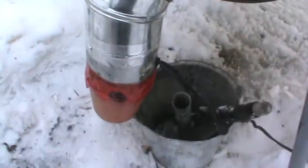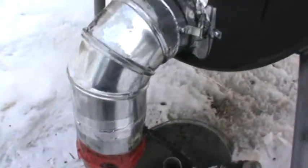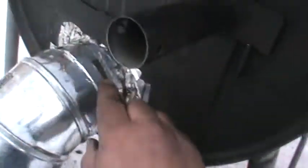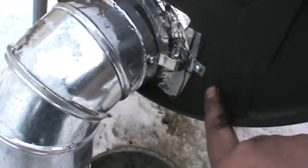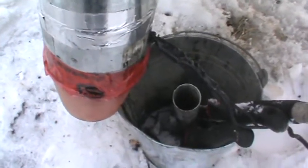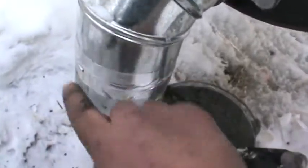I started out with just a 45-gallon drum which I converted into a burner, and I do have lots of videos on this already. What I've found is that controlling the draft with a duct fan has been the biggest impact on this whole project. You can see I've got a makeshift setup — just an elbow going into the original two-inch hole built right into the barrel, and this here is a duct blower fan. The pot is just to restrict the flow a little bit so it doesn't get the full blast of air. From there we have our power cord that goes back into the greenhouse, and that's how we control this blower fan — when there's a call for heat, this blower fan fires right up.